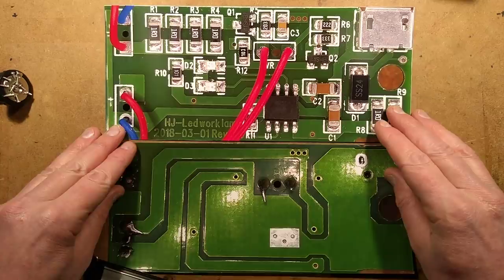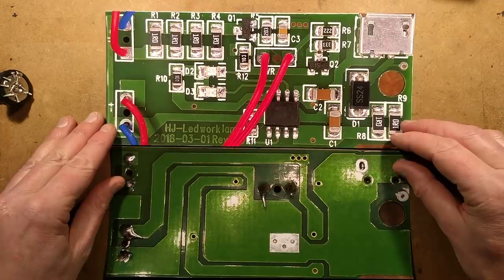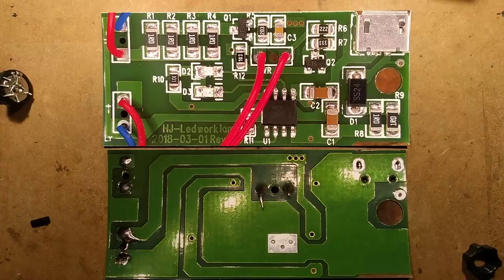I think they realized this heat is a bit of an issue, particularly during charging. If you plug in the charger while it's being used, it automatically cuts the intensity down using this MOSFET and these resistors — all very clever. I'll doodle out the schematic for you now. If you want to reverse engineer it yourself, freeze frame; otherwise I'll draw it out on my notepad.